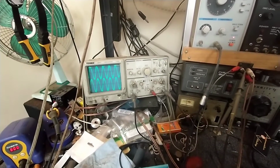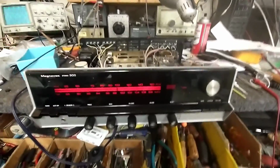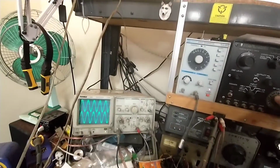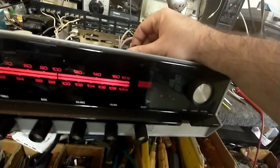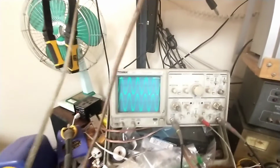Yeah, I could look at the service manual, but realistically, they just want you to have a really clean signal for stereo. But once you hit that 200 mark, that's okay. So it's decent sensitivity. Let's turn stereo off again and let's decrease. Make sure we're back on center here again. And maybe retouch our detector. That's pretty good. I'll turn the signal back up there. Turn our stereo pilot back on. So yeah, that's about as good as she's going to get.